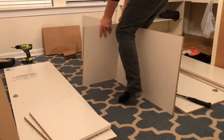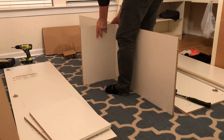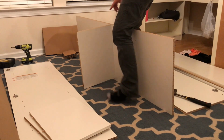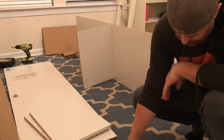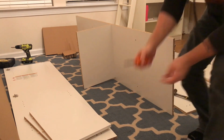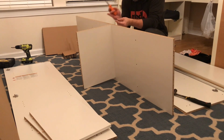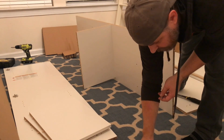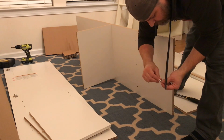we simply slide it into these holes. The dowels that we just put in will go into the holes in this piece, laminated edge down. These two edges are flush, and then we're going to grab a couple of these larger screws here, and those will screw through this piece. There's two holes going down this side. These will screw into that piece through this, and the screwdriver will do me no good because these are hex screws; this Allen wrench that comes with it will fit those screws.